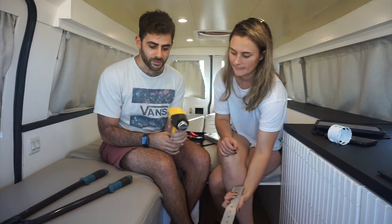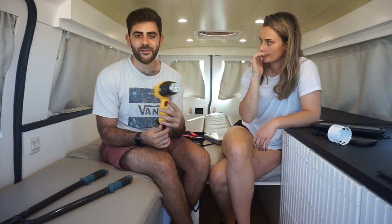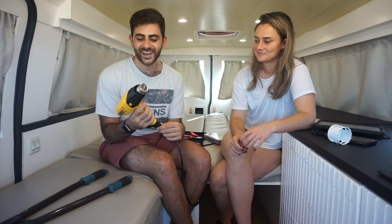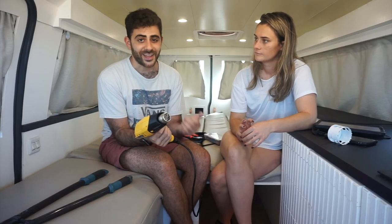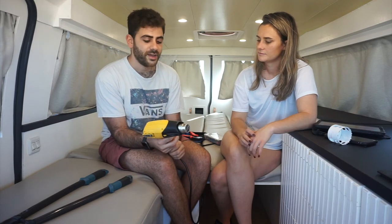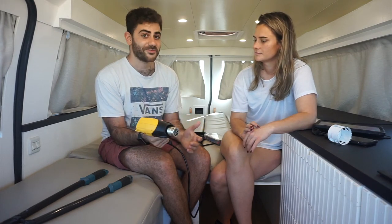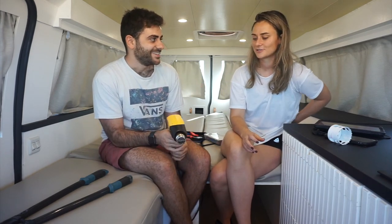The next thing is probably more straightforward — you might've already thought to get it. It's a heat shrink gun. You put this little shrink wrap at the end of the wire once you finish crimping, and it makes a tight seal. I saw a lot of people online using lighters or just electrical tape — that's definitely not a good idea for safety, and aesthetically it looks sloppy. Highly recommend getting this just for safety, it'll look much better, it's quicker, and it's really satisfying watching it shrink around the wire.